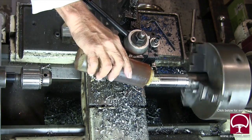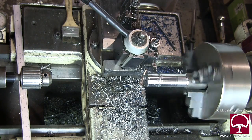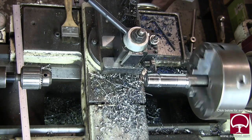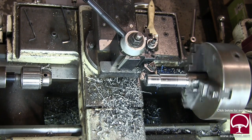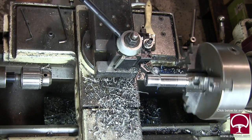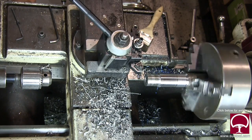We used a cutoff tool with a carbide insert — checked it out and it's deep enough. Then we're going to change tools and chase the thread. We had to make sure we had the right setting on the lathe for the thread. This happens to be 13 threads per inch, which is kind of a bastard size for this diameter — this diameter usually calls for a 12.